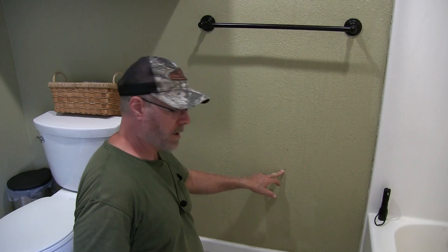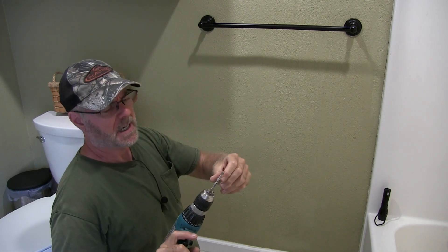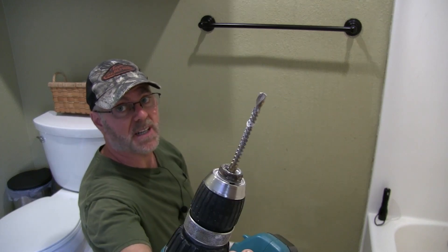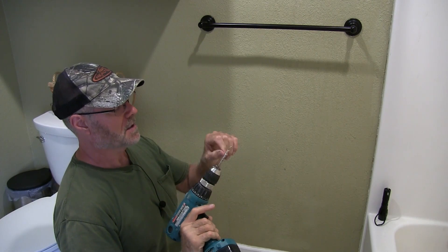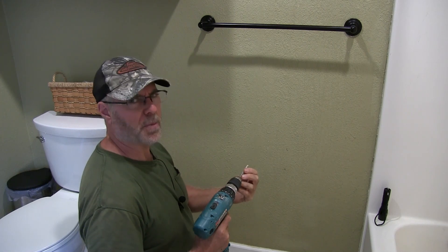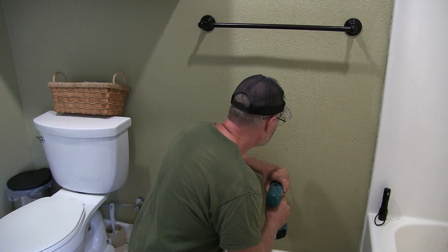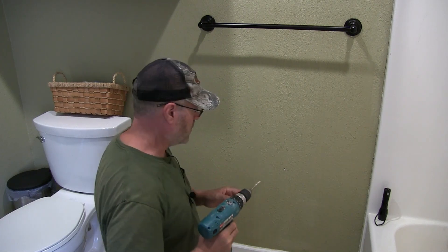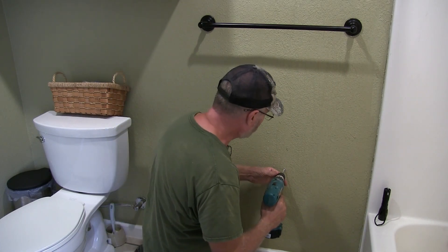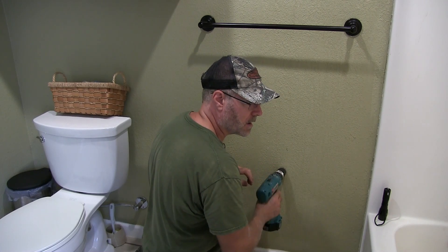I'm using what are called side-cutting drills — they've got a drill tip and cutting edges all the way around the sides. I'll put a link in the description where you can get these. They work pretty good for drywall and thin plywood. We're just going to drill a hole and as soon as you go through, pull it out — we don't know what's back there. Now we need to enlarge it a little bit. It doesn't feel like there's anything back there, but we're being safe.